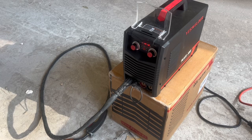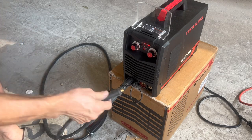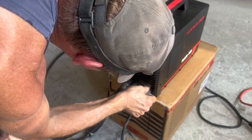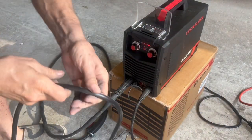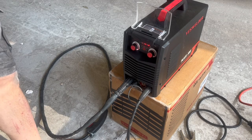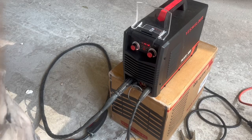The cone doesn't block my vision. Because the machine also does stick welding, it has a ground port and a positive port here in the front. I'm goofing up right now by putting the ground into the ground because this is a flux core machine — the ground cable is the positive and the gun is the negative. So I'll figure that out whenever I start trying to weld.